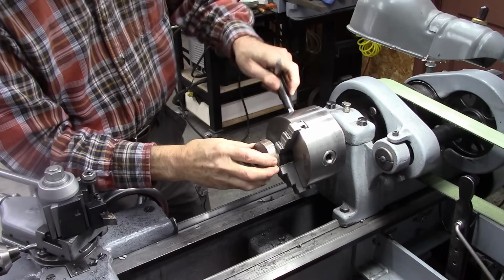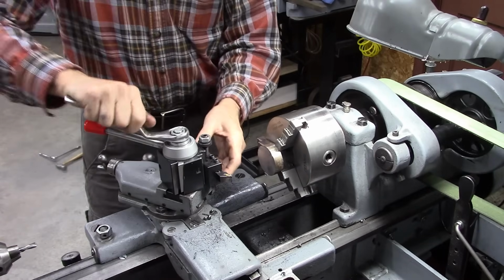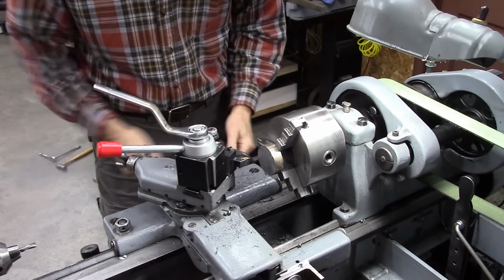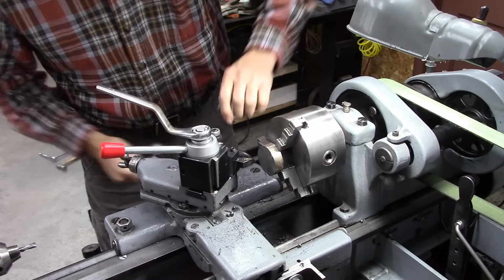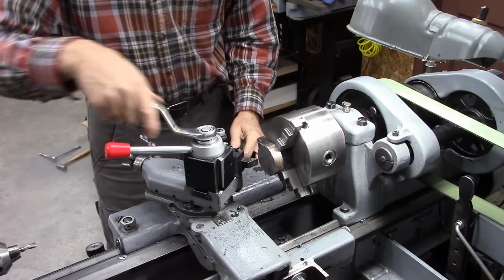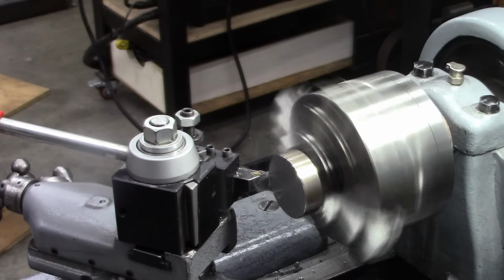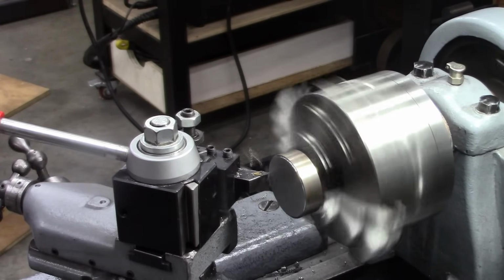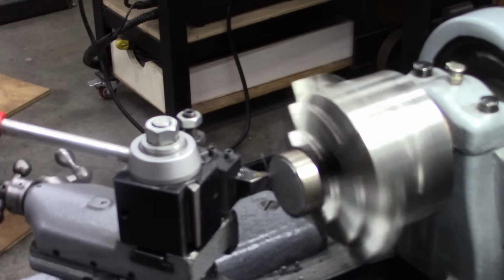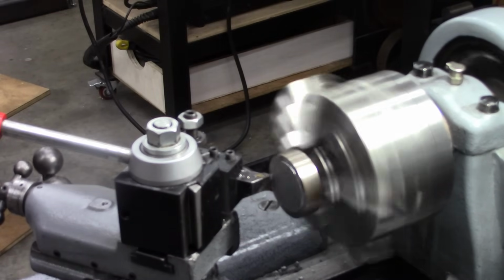Okay, first thing we got to do is surface both sides of this. I made some grooves in my chuck there. I know I brought that up several times before, but that is a super handy thing to be able to have, a little ledge in your chuck jaws to hold stock like this. This thickness is not critical. I made it slightly over 1/2 inch so that it would end up about 1/2 inch after we got done truing both edges, or both ends.